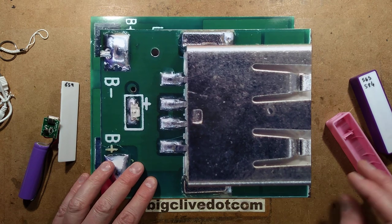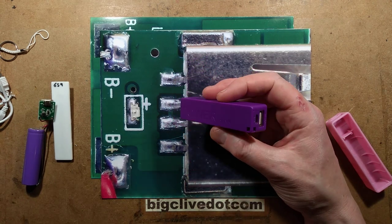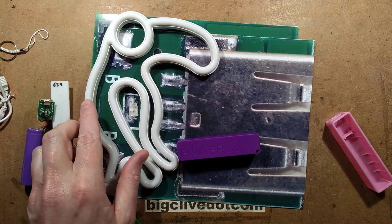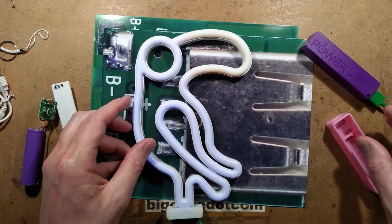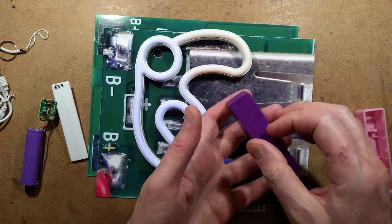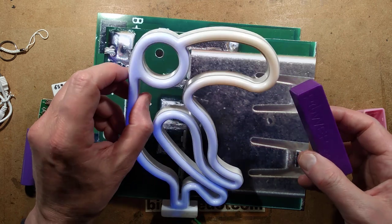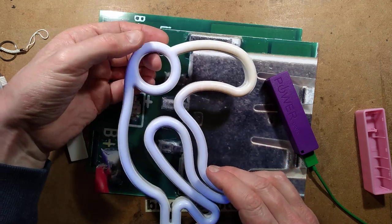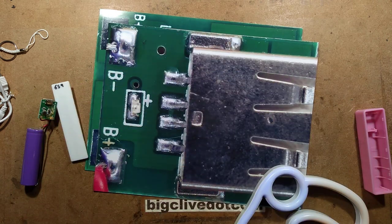And that's about it. I was using this in the video. I didn't know the capacity at the time. I used this in the live stream video to power the neon Toucan, this thing that Ebdy said looks like a breakdancer or bowler. And it did not last very long. Although this is only drawing about 100 milliamps, that low capacity of about 565 milliamp hour, plus the fact that it's got the boost losses, the conversion from the lower voltage up to 5 volts, meant that it just cut out quite early on. I didn't turn it on just before the stream. I had it on in the house, just hooked up on a nail, just for the novelty of it, really. But there we go. Yes, it cut out quite quickly.